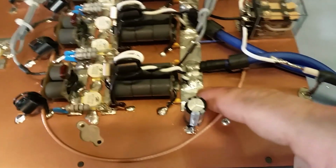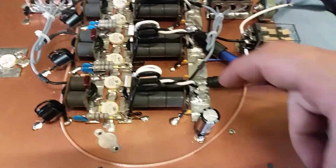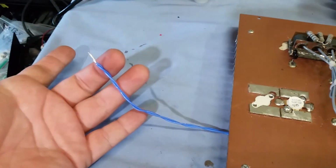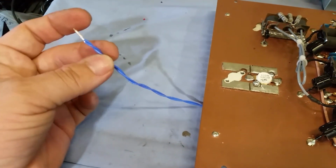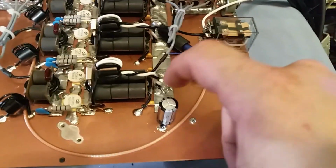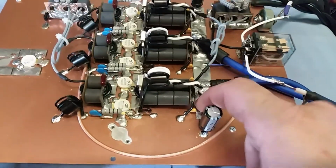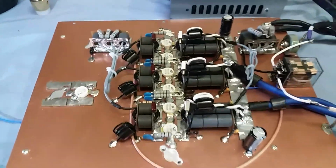One wire's coming from the hot bus, which you can actually see right there. I didn't go to all the trouble of actually having it like I would in a regular build. But this right here, you will just put on your switch, okay? You just put that on your switch. And you can use a continuity meter after you untwist these together to figure out which one is soldered to the hot bus and which one's soldered to the relay. So, alright, I'll be right back.